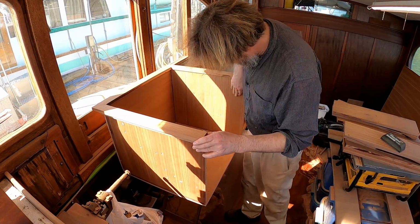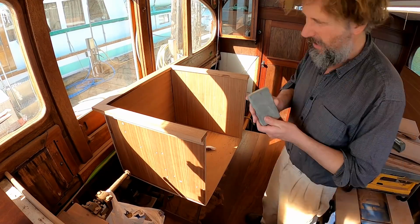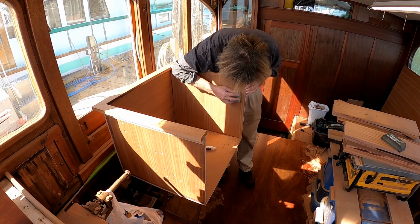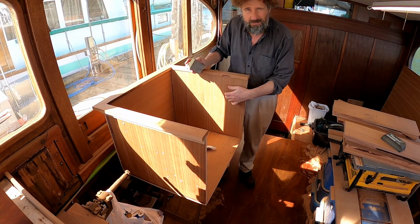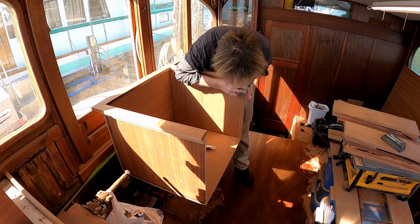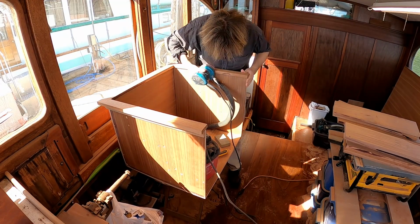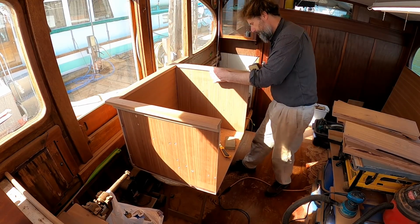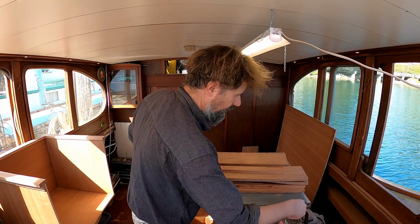The exposed area of this has already been sanded. What I need to do is just clean up a little bit inside with a sanding sponge where I have pencil marks, especially this stray one, which is really annoying me. Of course, this is veneered plywood, so you mustn't sand through the veneer. And on to the grunt work. No great joy here for sure.